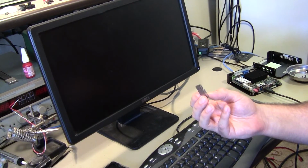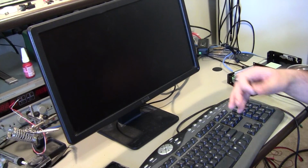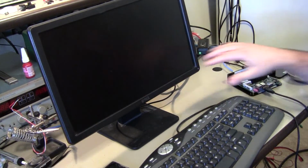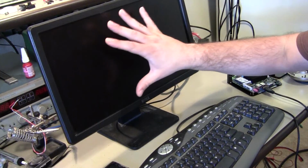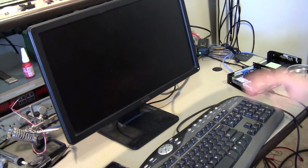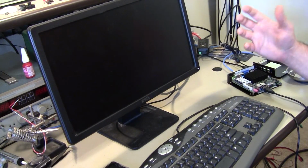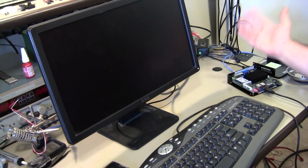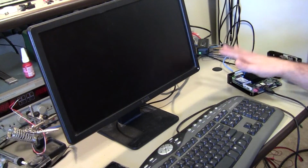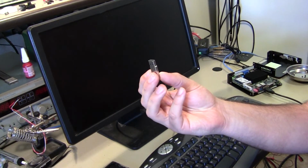I typically install Linux on my home network over PXE, which is a nice net boot protocol, so I can actually tell the computer to boot off the network and it'll have a menu about which OS I want to install out of the ones I typically use. I've had some difficulty getting the Qotoms to talk PXE on my network, and my router recently blew up and I don't have a PXE server at the moment until I rebuild it because, you know, backups are a thing. So we're just going to use the USB key here to install Debian Jessie.